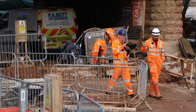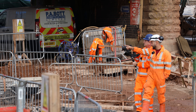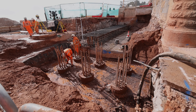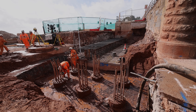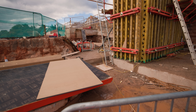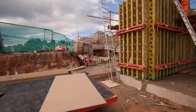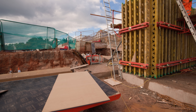The south abutment is the first of the link bridge pours to be done. Once it's done, you can see the gap which will fill in between the two. The last time we were here we were building the pile cap, the reinforced beam. We've pretty much got most of the pre-cast units to complete the remainder of the job up in our auxiliary compound on Timbeth Road, so everything's ready to go. As soon as the formwork's stripped out on Monday, we'll start putting the blocks in next week and backfill into the rear.